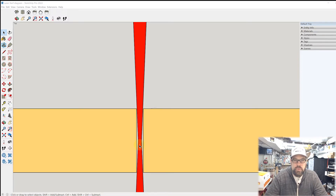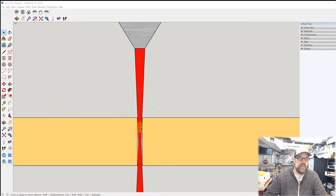What we're doing today is looking at how to measure the average cut thickness for a given material, then create an offset for it. Just like your material cut tests, you should do a kerf test if you're looking for high precision in your piece alignment. This is especially important where you want tight-fitting joints — fitting box joints where you don't want slop, or inlays where you want two pieces to fit together tightly without a gap.